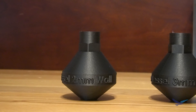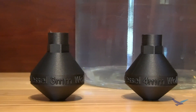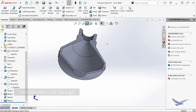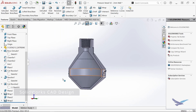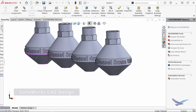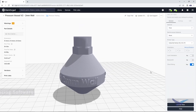We printed four pressure vessels on our X7 3D printer out of onyx material at wall thicknesses ranging from 2 millimeters to 5 millimeters. The goal was to place these parts under pressure using compressed air to see if they will leak. The design of these pressure vessels took some thought and planning using SolidWorks for the CAD portion. The vessel had to be designed so that no support material would be generated on the inside chamber of the part. Also, when it comes to threads, it can be advantageous to print them without supports for a cleaner thread profile, which will hopefully help improve performance and prevent leaks.